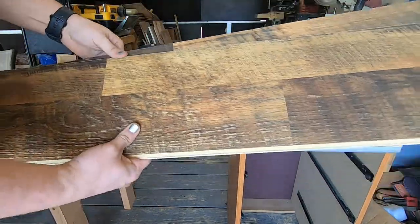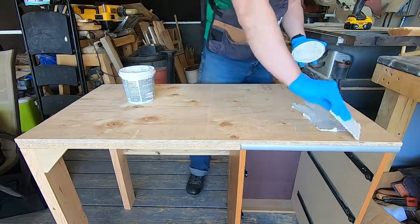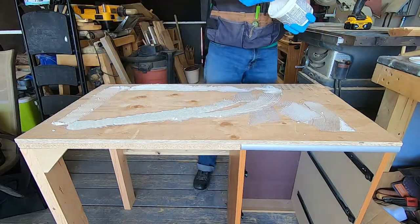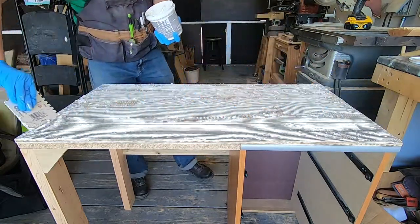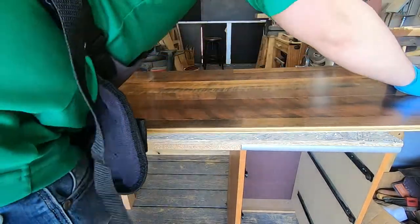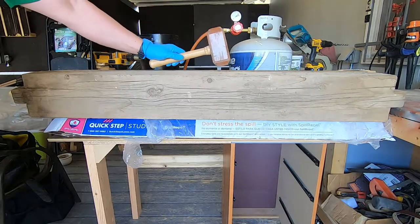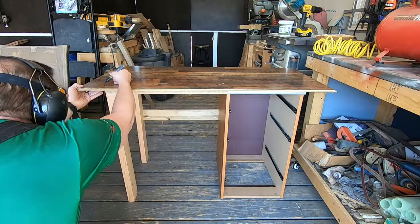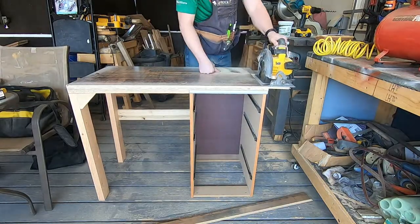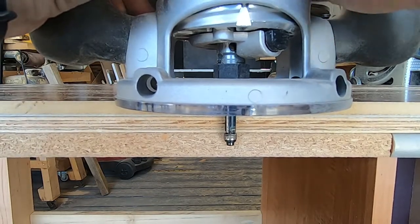For the top I'm using laminate flooring. If you ask for a sample, most store clerks can't be bothered to take it back to a saw and cut it. This is a tongue and groove style that clicks together. I smeared down the adhesive and used the disposable notch scraper until everything looked even — I'm not sure if there is a right way to do this, but there's no reason to start doing things the right way this late in the project. I put the laminate in place and then made a stack of heavy things to work as gravity clamps. Here I'm just marking out roughly where I can trim the top — these cuts don't have to be perfect. We're almost at the point where I can deploy that secret weapon: a flush trim router bit. The bearing will follow along the edge of the MDF and cabinet making all of those edges perfectly straight and flush.